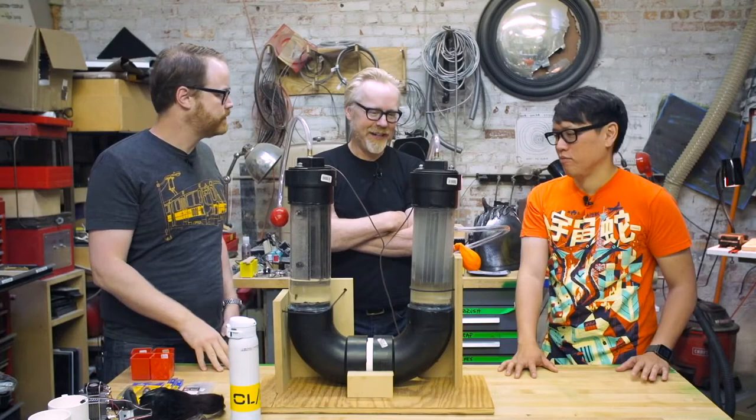Electrolysis works really well, but you have to have the electrodes in close separation. If you want to separate the hydrogen and oxygen streams, you have to devise a method where the electrodes are quite close together, or it does become inefficient. Using a huge tube with vast separation is just useless. At the end of the clip, they produced what looks like a very wimpy balloon supposedly filled with hydrogen - it appears to be inflating and deflating and looks like they've disconnected it and are just blowing into it. I don't think they even collected any hydrogen in the end. I think they faked even that.